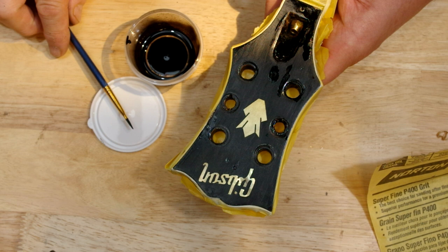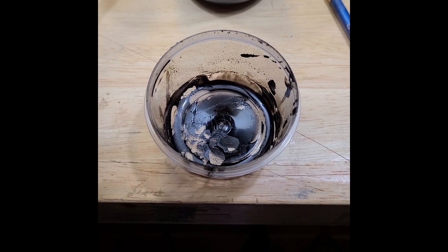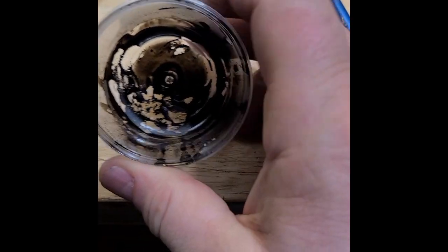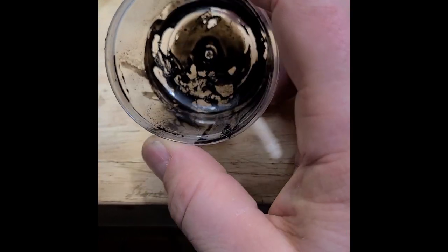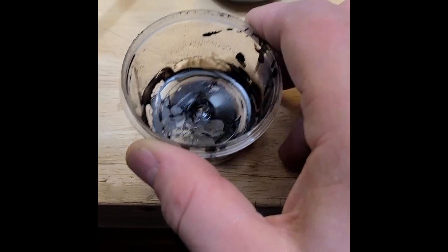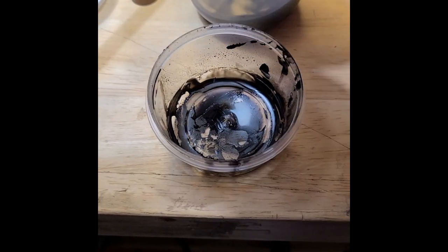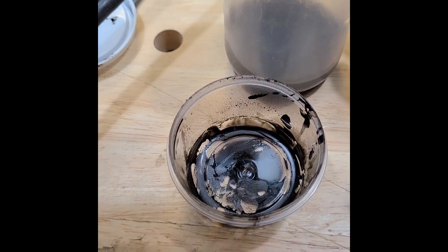Now, just to contrast that, and why I think so many people are afraid to use lacquer, is that the polyurethane finishes and other poly types don't have any evaporation, so they don't have pinholing. You can put them on as thick as you like. They just harden where they stand, and they don't rely on atmospheric evaporation or anything else like that. So no shrinking and no contracting of the finishes. So in that respect, they are easier, but I find them to be much more limiting, actually.